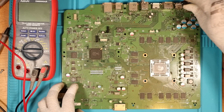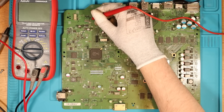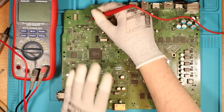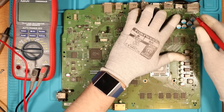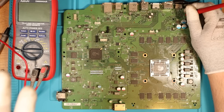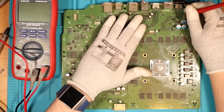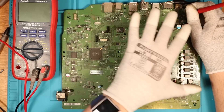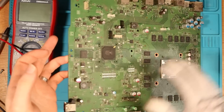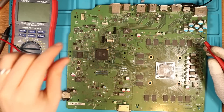I've got a power supply unit set to five volts and five amps. If I inject five volts at these little fuses, I get 170 milliamps draw, which won't really tell me if anything is getting massively hot. However, when I go to this component in the top right — I believe it's a transistor — and inject the voltage, it goes down to 1.63 volts and draws a full five amps. After speaking to Chris from iFix Consoles — top bloke, always helps me out — he stated that if the short is a direct connection to the ground plane, I won't be able to see which component is getting hot. However, as I'm speaking, I've just felt the board get very hot. I think I found it — my hand is burning.